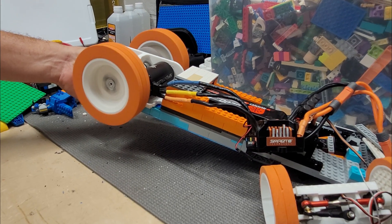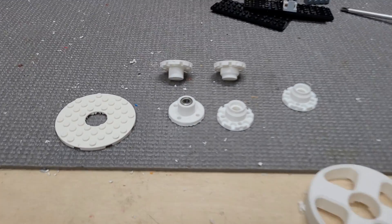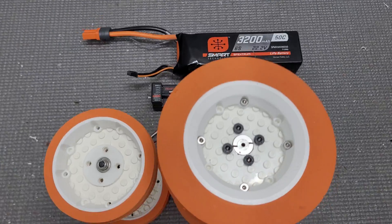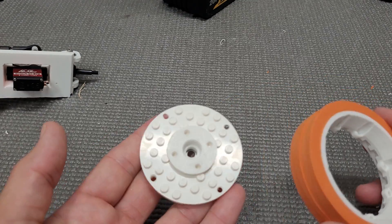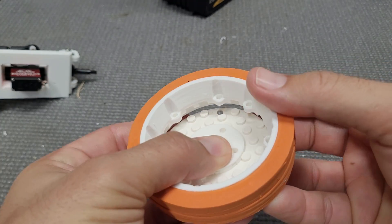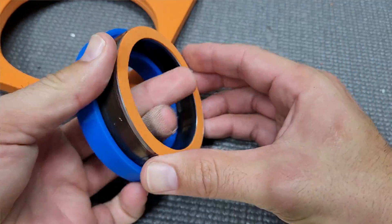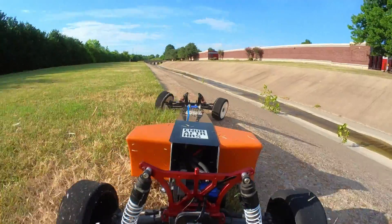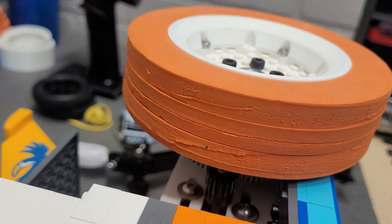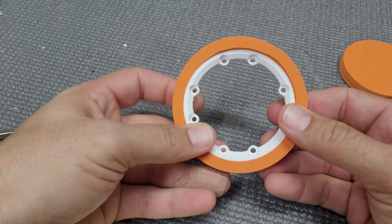Since I wanted to go so much faster than him, I had to make my own wheels. This involved an actual LEGO circle plate and a few small 3D printed modifications so it can actually bolt up to the driveline. The 3D printed parts also had LEGO patterns designed into them so they would click into place. I also had to custom cut my own foam donuts to bond onto these wheels, and this foam is pretty similar to what you see on real RC foam wheels, except I'm having to compile them from half-inch thick sheets of foam since I can't process any material thicker.